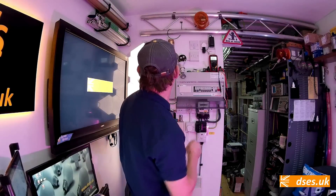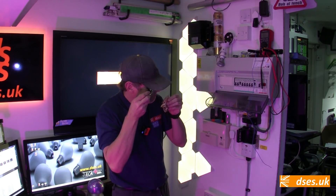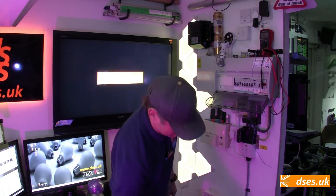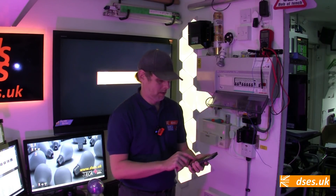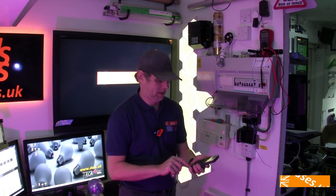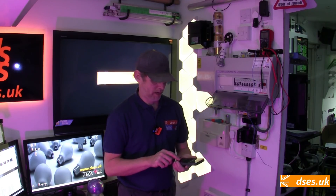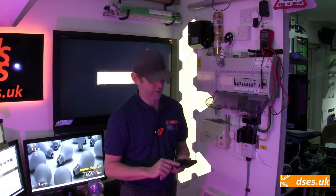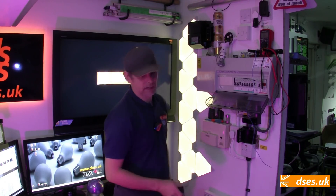...it seems I bought 390 ohm resistors, not 390 kilohm resistors. What would that have been? 230 over 390 — we just pumped over half an amp through my poor little resistor: 230 squared over 390 is just over 135 watts through my quarter-watt resistor. No wonder there were fireworks. Let's see what other resistors we've got.